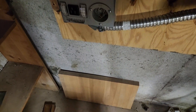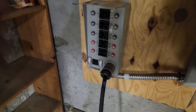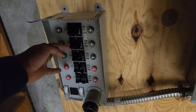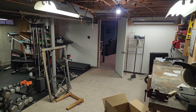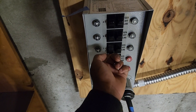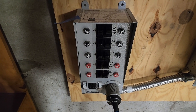Then we can go ahead and plug our cord in. Now I got that plugged in and I can switch off. Let's say basement lights, which is number 13, which is number B — so I can switch that off. My basement lights shut off. Hit generator — they come back on. So I'm going to flip everything over to generator power and test to see if the whole house will be powered by the generator. And now the whole house is on generator power.